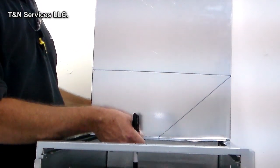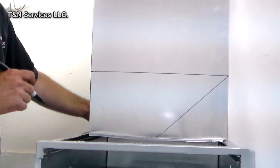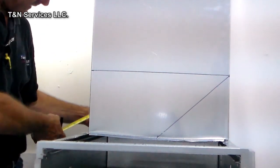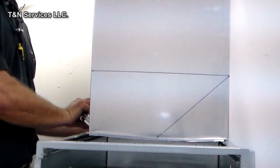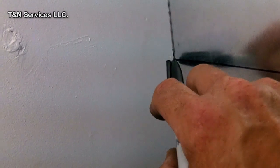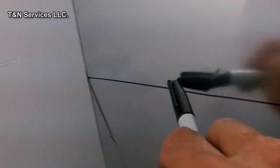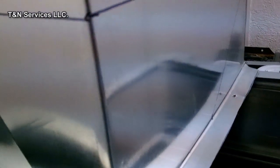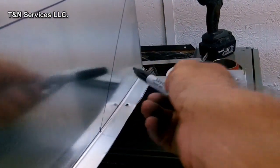On the side we're going to do the exact same thing. Our side measurement is two inches, so we'll go from the back two inches over. As you can see, we've got a two-inch line there and we went up six inches, then we took our six-inch line and went all the way across the duct to the corner — and it matched the other one we did earlier. Then we have our seven-inch line. Now we're going to cut all this out of here, and do the exact same thing down there — it's going to be a mirror image.